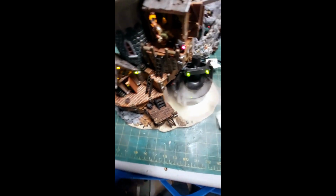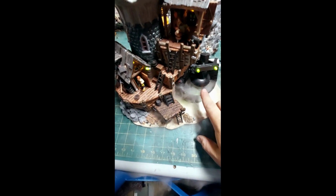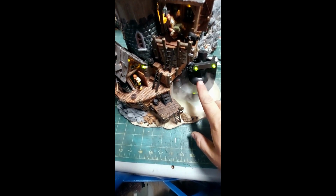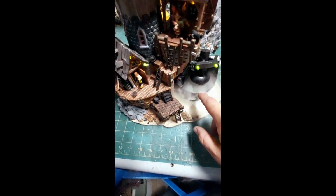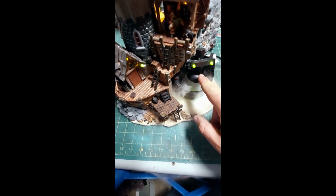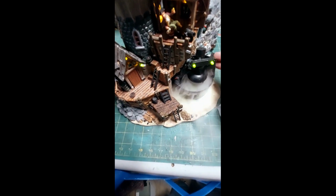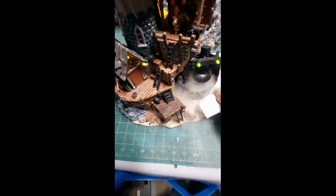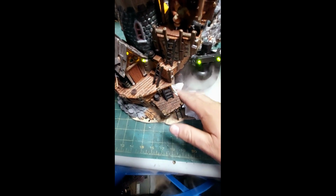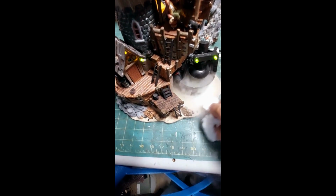And that's because the disc in here, instead of using the wick to the disc, is actually vibrating the water. This dome is to catch the water and make it drip back down. Then the fan, which is right there, makes it blow the mist out. That's why this got this shroud here on the back to help push it out of the front, which also pushes out the water droplets that aren't in a mist form, and then you get all this water everywhere.